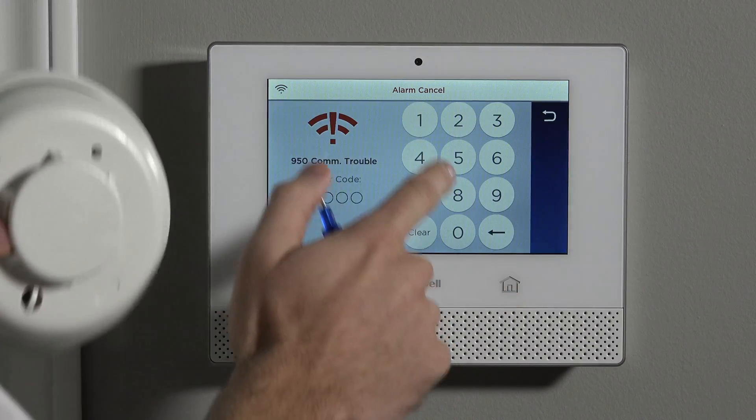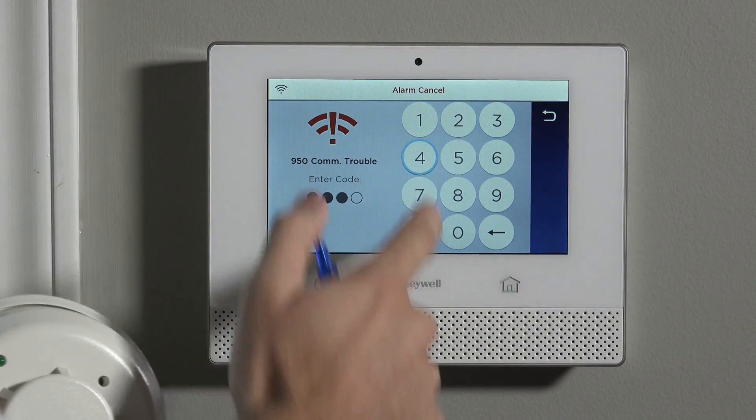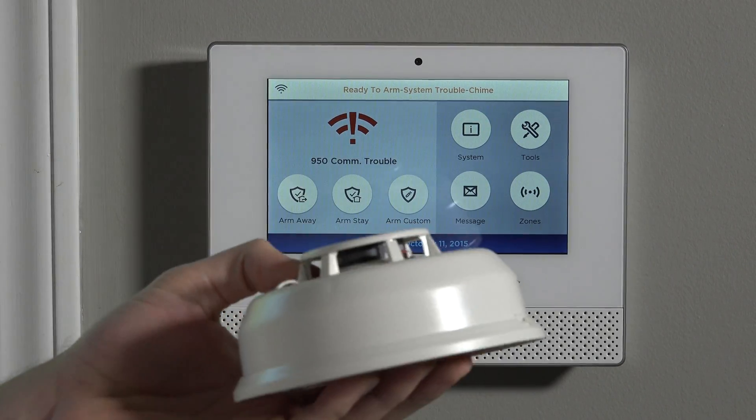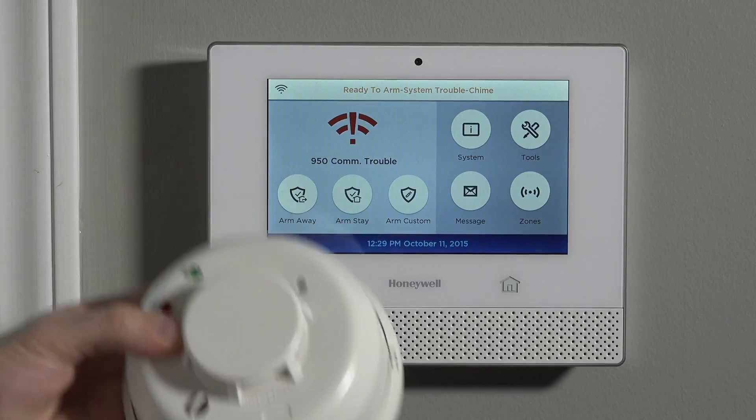The device was in alarm mode until I let go. The panel's in alarm mode until we disarm. So when we're holding the switch down, that's basically like saying smoke is in the chamber. The device will make that loud noise locally at this device only, but as long as it's been programmed to the panel, that alarm will set off the panel alarm as well. As soon as we let go of the test switch, the local sounder and smoke alert stopped. The panel stays in alarm mode until either the four-minute fire timeout kicks in, or disarming the system turns it off.